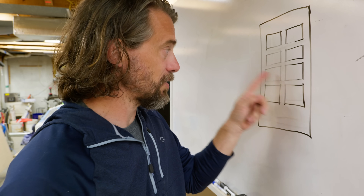To try to keep these new doors similar to the old doors, I'm going to have the same number of glass panels, and the dimensions of those panels are going to be really, really close, but the doors themselves are very different sizes, which means I have to change the dimensions of all the wood around the glass. These pieces are four inches wide, and that means I can't build this door out of two-by-fours. A really common method for building this kind of door is to use two-by-fours for the verticals and horizontals, trim off the rounded edges and make everything sharp, then put the pieces together — but these aren't wide enough. I still need the thickness of a two-by-four, but the width is not enough. You could go to a two-by-six, but then you have to cut off a bunch of extra stuff, so I think we're going to make the whole thing out of MDF.